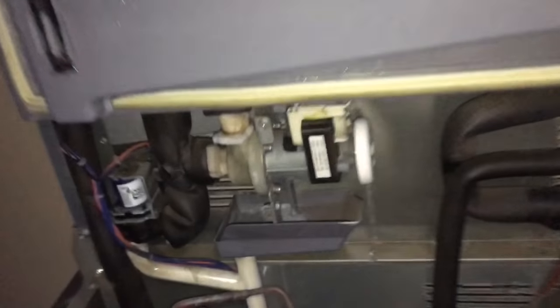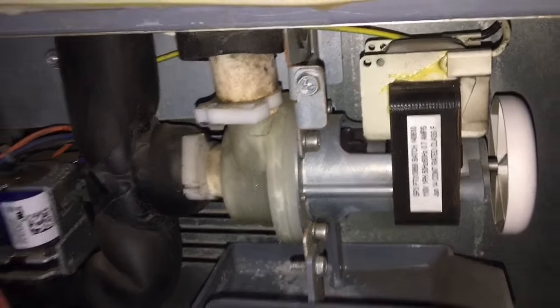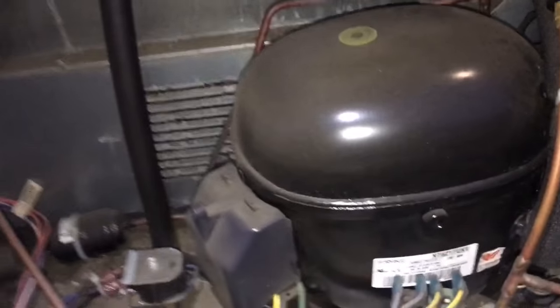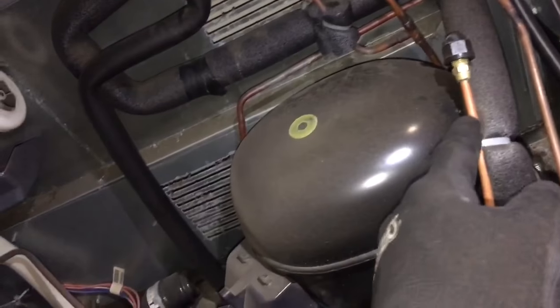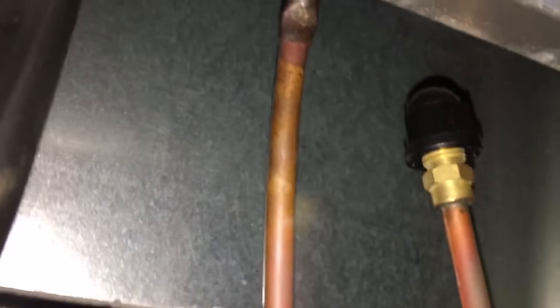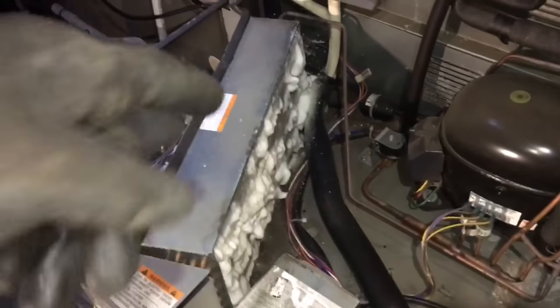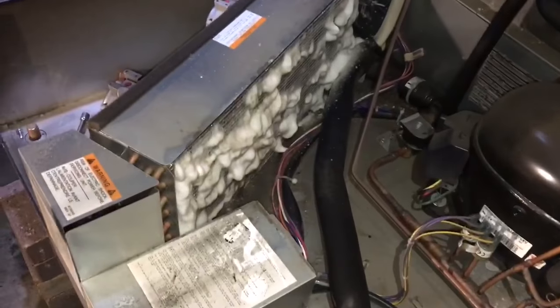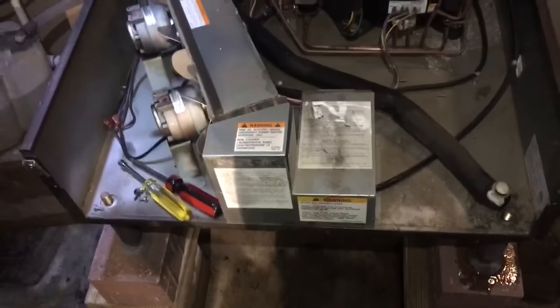There's your water pump. Your dump valve. And that's how you're getting on to your high side — it's right here. The low side tap is right up there. I got the condenser cleaning going. If you're ever going to clean a condenser on one of these, you have to pull that bin off — you cannot get to that condenser coil without taking the bin off. Because this is going to be the front and that's all you're going to have. This space here is all filled up, and I'll show you that when I get it back together.